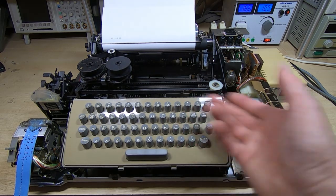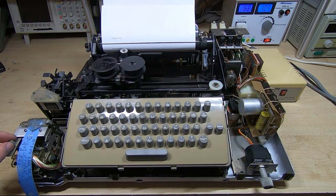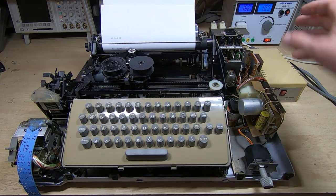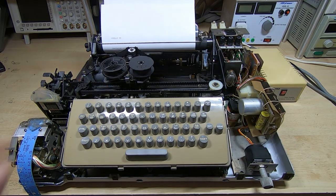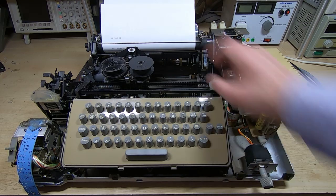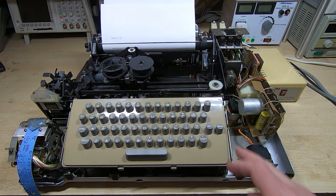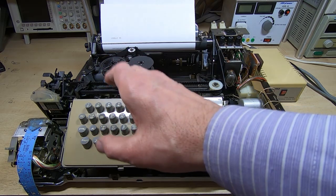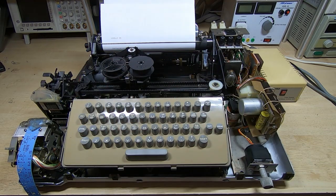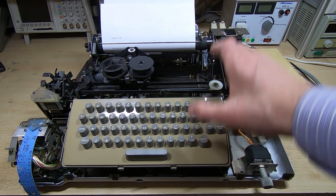As you can see it's working as intended. I can also trigger the tape reader, so I can read a tape into this machine — it's only printing it out of course. If I put tape into the punch and set it to on it would punch any characters appearing on the printer. Some characters aren't punched and some aren't printed — there's a mix. Some are control characters for the punch; for example a punch-off character would stop the punch, so there's little value in punching that. It depends on the configuration of the system.